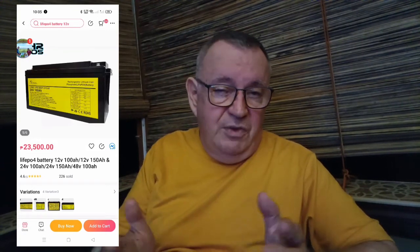Like at 6 a.m. in the morning, I'm probably only getting about 1 amp at this time of year. So until about 7:30 or 8, I don't get enough to overcome the drain of the refrigerator and deep freeze, plus the other accessories that are up and running too. I've got a TV and my Wi-Fi and all that stuff, and phone chargers. You could probably add another 150 watts to that when I get up in the mornings like right now.